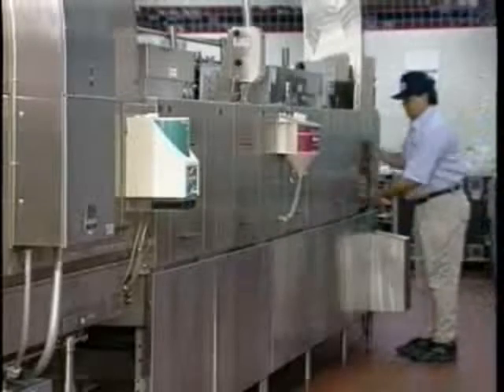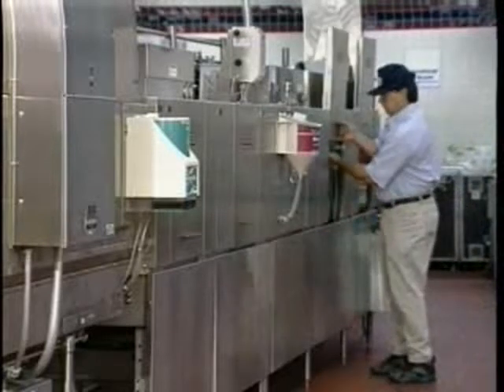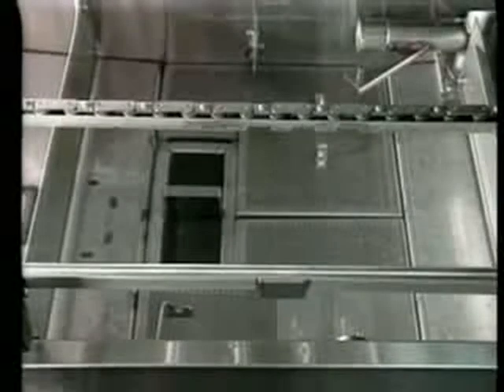There are five access doors on the FRC. The machine will not run if any doors are open in the pre-wash, wash, or rinse sections. There are strainer baskets and strainer pans behind each FRC door. Short and long curtains are hung at different openings inside the FRC. Their location is indicated with small black signs. The short curtains must be placed in their appropriate locations for the machine to function properly.